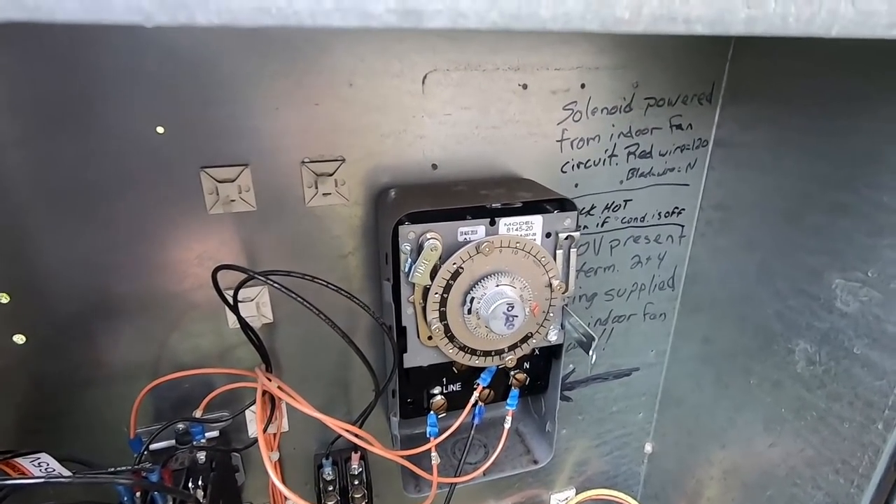I went back a few weeks after doing this video and checked the evaporator coil to make sure it wasn't starting to freeze up, and it was not — which is good. I had a feeling when the clock was a little hard to turn and had some weird clicks like it didn't want to engage and disengage the way it should. I think all those things combined — possibly the pressure switch being out of whack — didn't help things. Surely the dirty coil didn't help, but I've seen ones a whole lot worse than that not cause that kind of ice buildup.